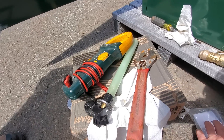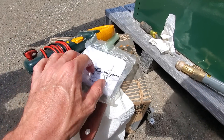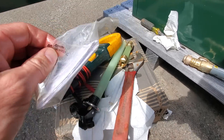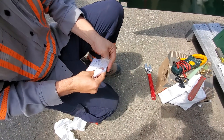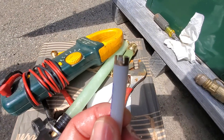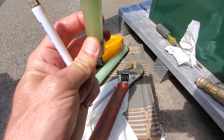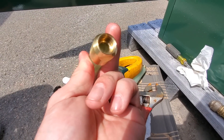This is what the bayonet fuse looks like, and it is stamped directly on the fuse — the fuse size: 100 amp. We're not going to put the same fuse back in. We have a Cooper Power Systems 100 amp fuse — there's 7,200 volts going through this guy. So we'll get that opened up. This is what a new fuse looks like — you can see the end is perfectly straight, as opposed to being kind of mushroomed.